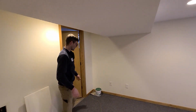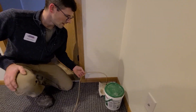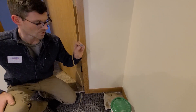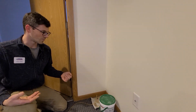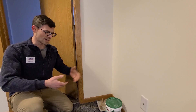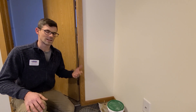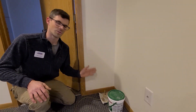We've got our test holes here — I've got about eight of them in this house so far. We just pulled back a corner of the carpet, drilled a half-inch hole through the slab, and put a rubber cork in the hole. This allows us to measure the suction the radon fan is creating. The key to getting your levels low is to create negative suction — or vacuum — under the entire house. When we're done we'll fill that hole back in and put the carpet back and you will never know it was there.